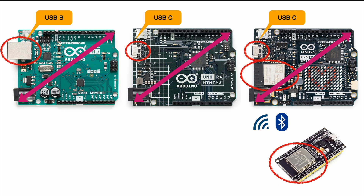The R4 Wi-Fi also has another new port in the right end corner. It's a connector established by SparkFun to easily connect I2C sensors and other boards for educational purposes, providing a quick setup without relying on jumper cables, which can be quite unstable for high-frequency I2C communication.